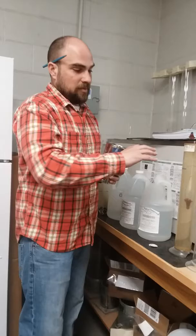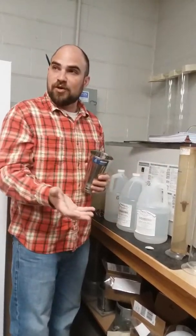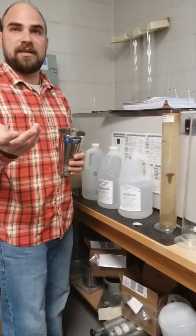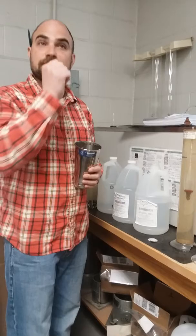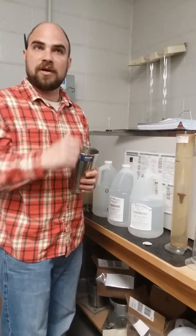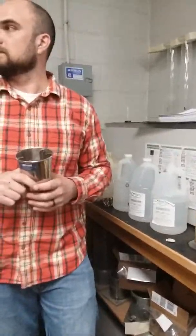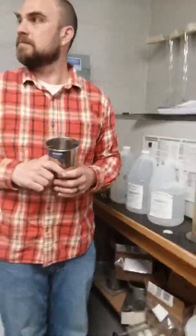If you are running a moisture content sample, obviously you're not running it on the sample that you just saturated here. To begin with, you'd have a separate sample. So when it mentions hygroscopic moisture content in the spec, that's a separate sample. It's not what you actually conducted this test on. Everybody understands that?